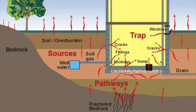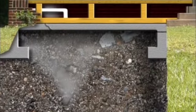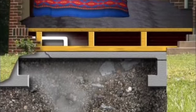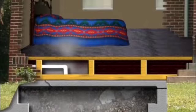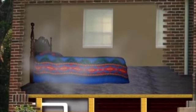In this video, we're going to look at our radon system, how we went about installing it, and how it's worked for us so far. Radon is a radioactive particle that is in the soil, constantly being released by the soil. Basements, especially, are open areas. There's a pocket of low pressure. Particles will move from high pressure to low pressure, so it comes in through the soil and into the basement, and often will get trapped inside the house and circulated.